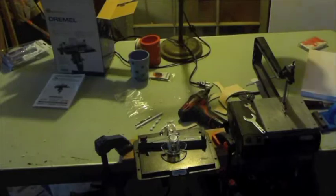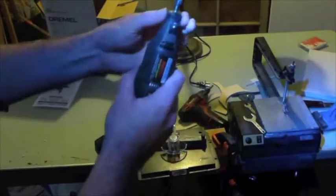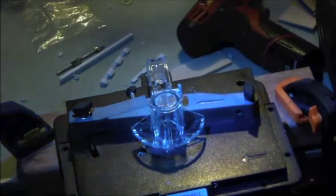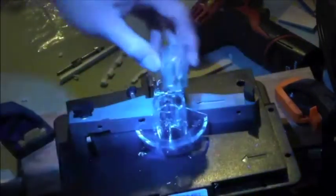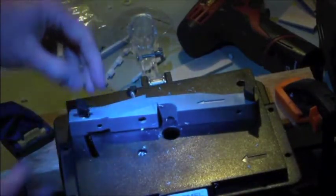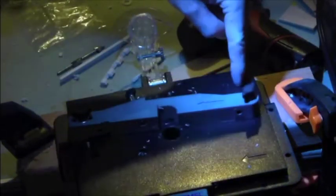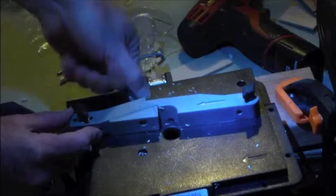For the 395 at least, you have to take off the collar on your Dremel — it uses a thread to attach. As far as functions, it's pretty straightforward: you've got your safety cover piece, a removable core inside, your guide, and some plastic thumb screws. They could have longer threads since they fall off a lot, but so far I haven't had a big problem. You've got a rotation — this one moves back through three different stages so you can set your angle and allow for more material depth.